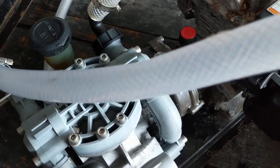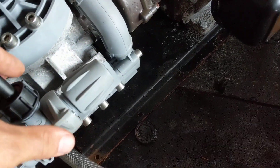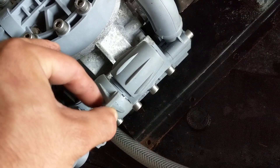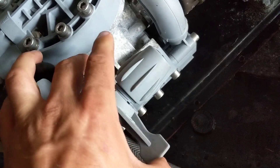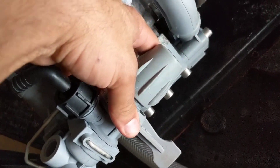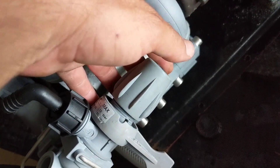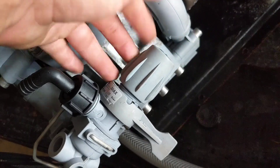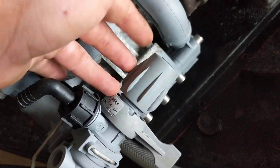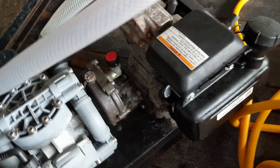It's really important to leave this open. You can close it a little bit to get your pressure up slightly, but I don't recommend closing it completely. This is your unloader valve for your soft wash system. It's one of the few parts that can fail, but it's an inexpensive portion of the system.